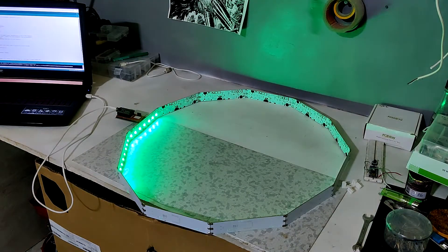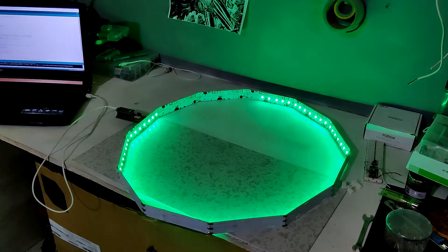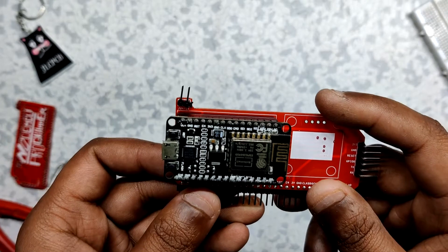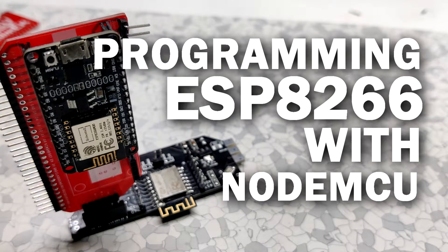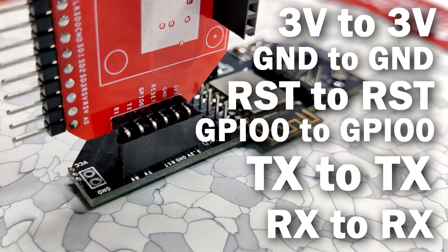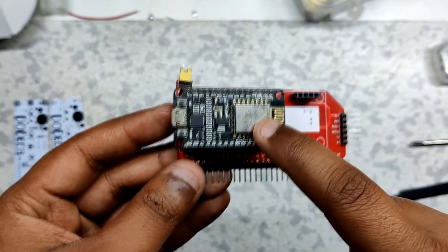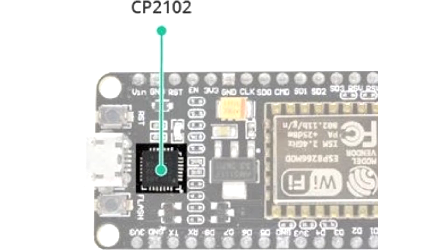I will first upload a hello-world code for WS2812B LEDs to this setup. For uploading the code, I will use my NodeMCU programmer — which is actually a NodeMCU whose ESP12F module has been powered down — so we use its CP2102 chip. For a detailed explanation check out my previous video. The NodeMCU setup has breakout points: 3V to 3V, GND to GND, RESET to RESET, GPIO0 to GPIO0 (D3 is GPIO0 on NodeMCU), TX to TX, and RX to RX. I added a jumper wire between the enable and GND pin of the NodeMCU, which turns off its ESP12F so our external ESP12F connects with the NodeMCU CP2102 chip.